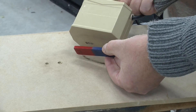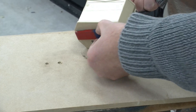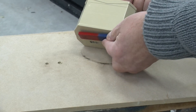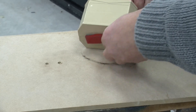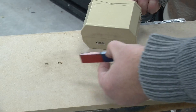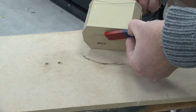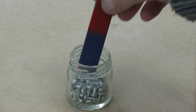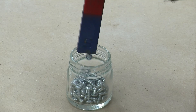It's all plugged in. What I'm going to do is turn on the demagnetizer, put my magnet on it, move it around, and then move it away very slowly. You can probably hear the field because it's AC. I'll slowly move it around, turn it over, and slowly move it away, repeating this a few times. At this point it should be a lot less magnetic. Let's see — yeah, look at that, it hardly picks up any of our screws.